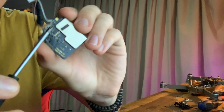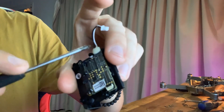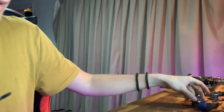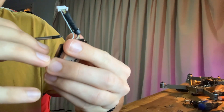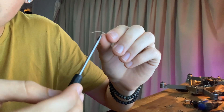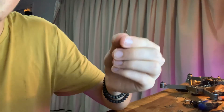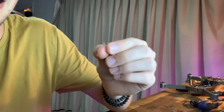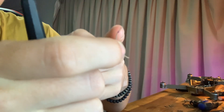I had a look at the boards themselves. Across the area where all the wires are, there's a silicone glue that sticks on there to protect the wires and waterproof them. I scraped all that off, and what I noticed was one of the wires — the SCL wire — had a little dark spot on it. You can just see there's a bit of discoloration and a dark spot. I just took my best guess that was the issue. There was a bit of a burn mark on that wire.